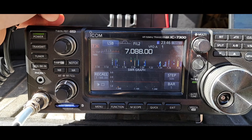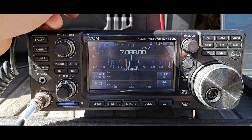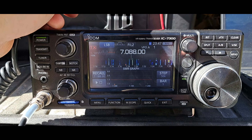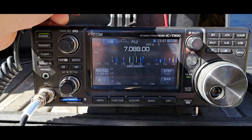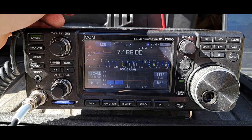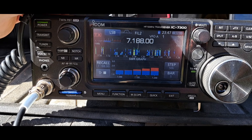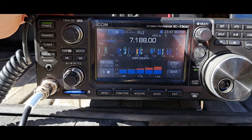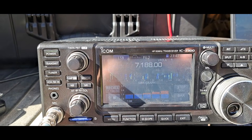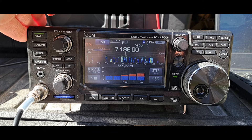For the 40-meter band, your SWR is going to be just a fudge higher on 40. We can adjust the height of that feed point and the angle of those radials — you could adjust the length a little bit — but the 17-foot radials work well for 40, believe it or not. The SWR as we go through — the highest, as you get up closer to 7300, looks like about 1.8 to 1. So you're averaging somewhere around 1.5 to 1 on 40. Not horrible actually — pretty good. I can tweak it a little bit and get it down just like 20 was.